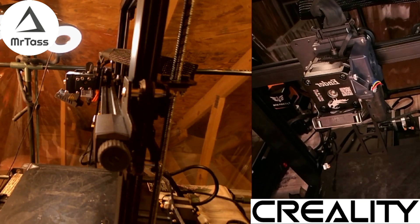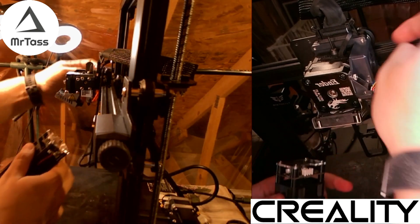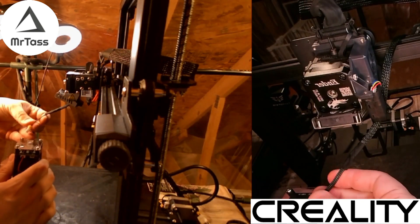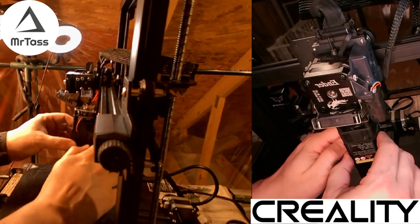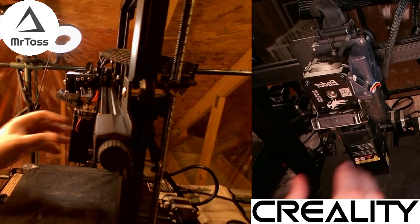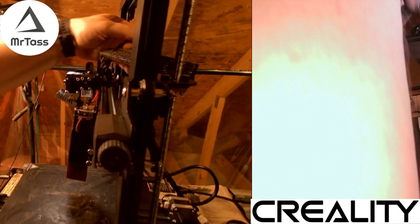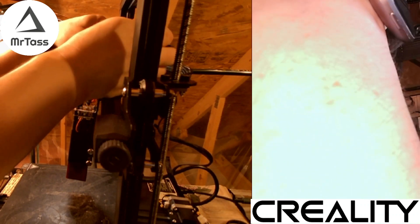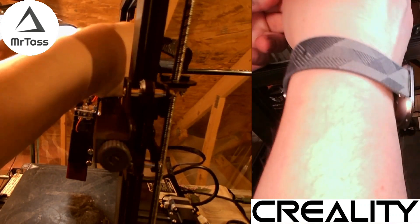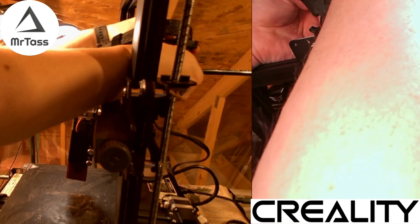Now we can install the laser itself. Here's the laser — you can see it's got the port on the top for the Z cable. I'm going to bring the Z cable up and over, plug that in first — makes it easier. Then this slides onto the bracket, and you use these little thumb screws to tighten it in place. It has a magnetic underside protection. So this is now pretty much installed. If you want to leave the Z line up there permanently, give it a little slack and use the included Velcros to keep the Z cable in line and out of the way.